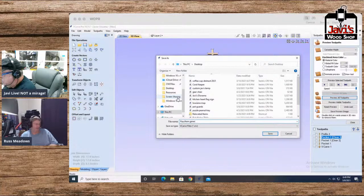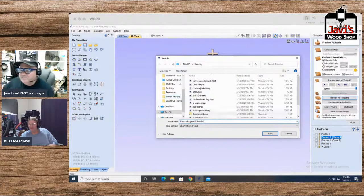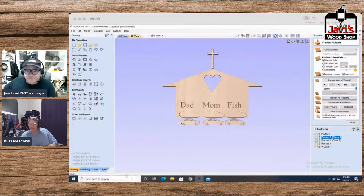Well, Mako answered his question, or he came back with more information. He said he has installed homing switches on his CNC, and after sending the machine home, now he wants to save tools in the library, and he uses a 3-inch block to touch off with. But when he comes back and tries to use them the next day, they're off a few inches. You put the block on top of the homing thing to touch off the machine home. Still not completely clear.